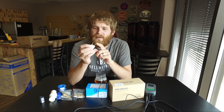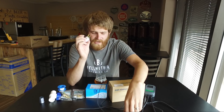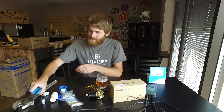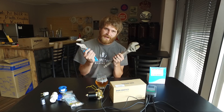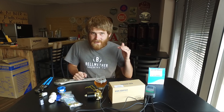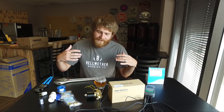Finally we have a nipple to link the ball valve to the solenoid. This one happens to be plastic — you can buy brass if you want, but plastic is usually a little cheaper and works perfectly for this situation. Lastly I've got a plug that will go from the wiring in the solenoid into our Inkbird unit. So let's go ahead and put this together. One more thing I forgot to mention: it helps to have a couple of wrenches on hand. Now I'm gonna start a time-lapse of me throwing all this together.